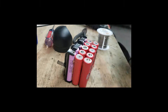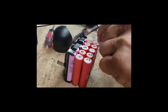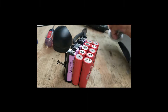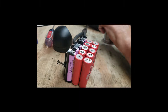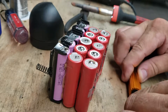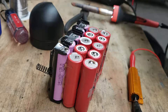So you just have to be careful. Biggest thing here is just don't short anything out or you might have a bad day. So we do this with a little more solder — we've got one cell to go. Then we'll have to put a load across these to help balance them out. What I'm going to do now is put a 100-watt 4-ohm resistor across these things to help load balance the cells. I'll get my meter over here and see how much current these things are drawing between cells, which will tell me how out of balance they are.